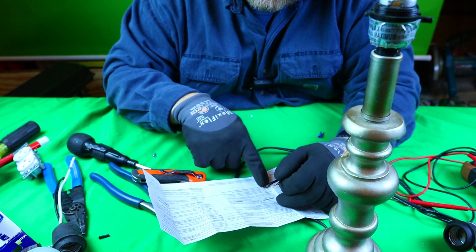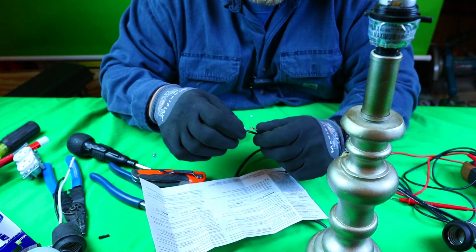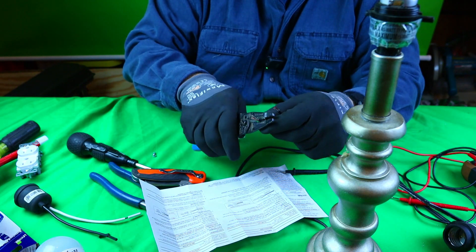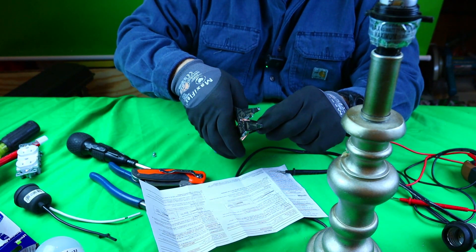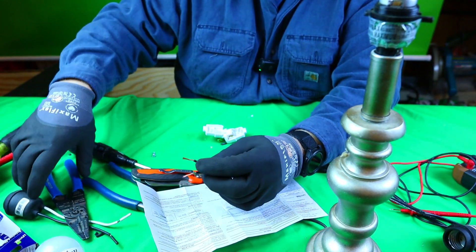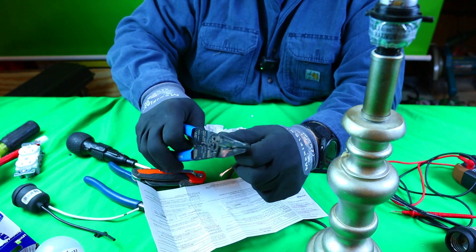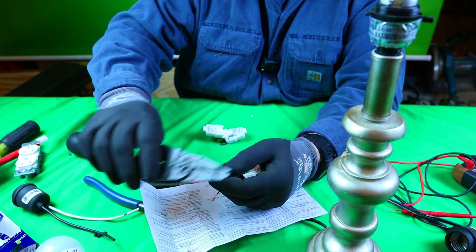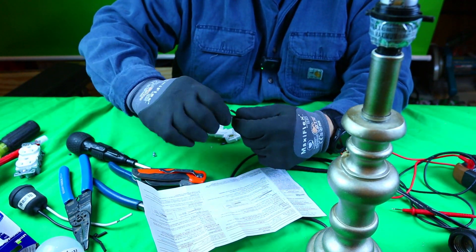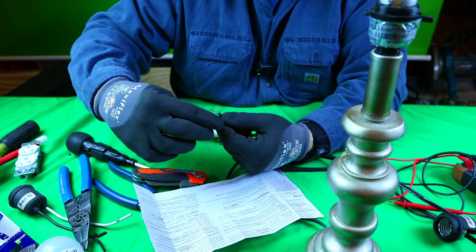So we know that that's right. We have to loop the wires clockwise, three quarters turn around the screw, and tighten to 10 to 12 pounds. I'm going to cut them just a little bit more because I want to make sure they're about the same length. These strippers, guys, are really nice — they cut screws also right here and I'm going to do a video on this, so be on the watch out. We will twist our wires here. Now we'll loop them — all we're going to do is put a little loop in them.